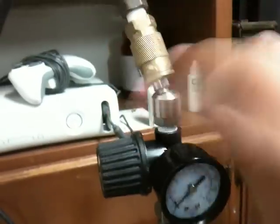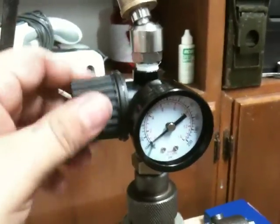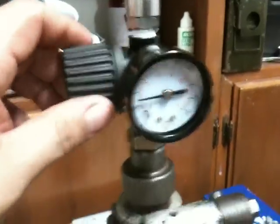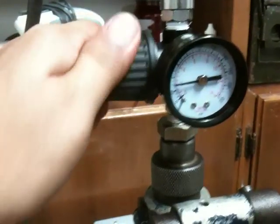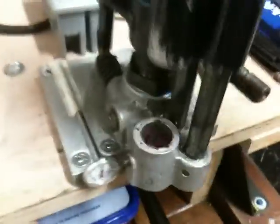We've got an air fitting on there. This is a temporary air fitting — I intend to put a multi-swivel type so the hose stays out of the way when sizing. The regulator helps you control air pressure. I've dialed it up to about 30 pounds, but we don't need that much since we're using hard lube and it's heated, so I'm setting it to about 20 pounds. I want to show you that there is a little bit of lube coming out. We've added pressure to the system, so let's try it.